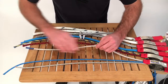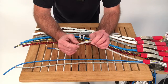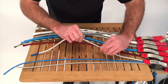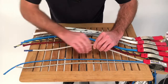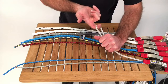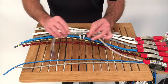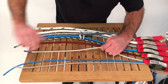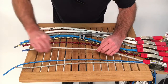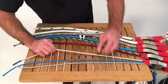This one's a bit softer, so I'm going to make sure that I put a good amount of pressure on it. With 12 strands, high-techs like this, especially the Dyneemas, they're not always round. So it's important that you get any flat spots out of the line before you measure it. And if this was a used piece of 12 strand and it's been under load, under like a strop or something, you'll see that it's really flattened out in those areas. It wouldn't be a good area to measure. So this, I'm actually trying to get this completely round right now. Okay, I don't feel any flat spots anymore. And I'm going to get it under pressure.